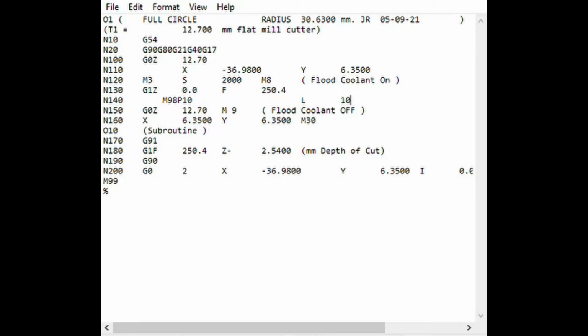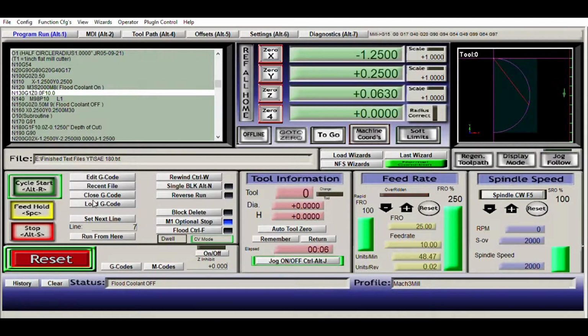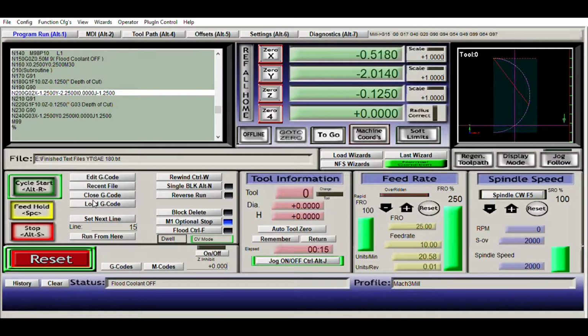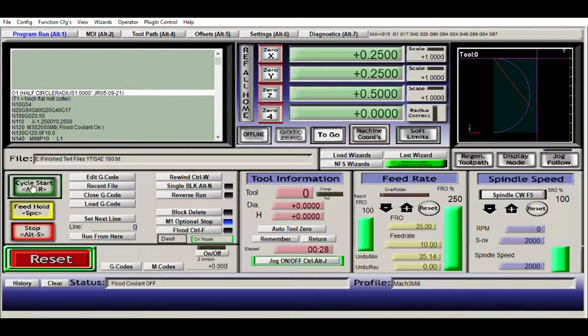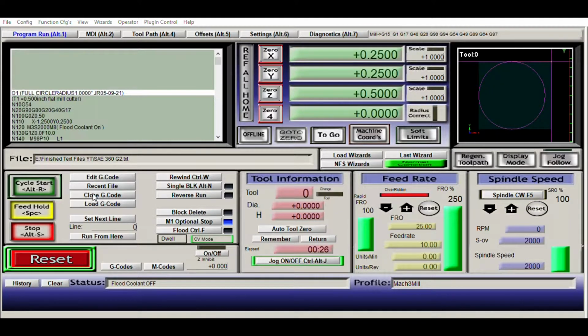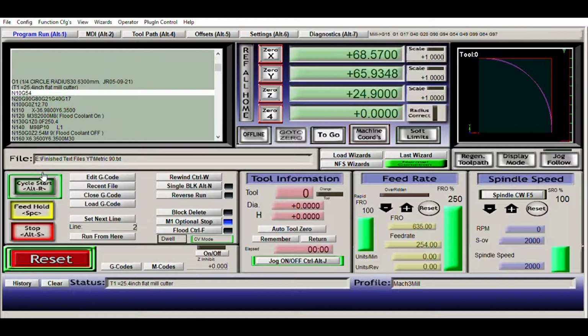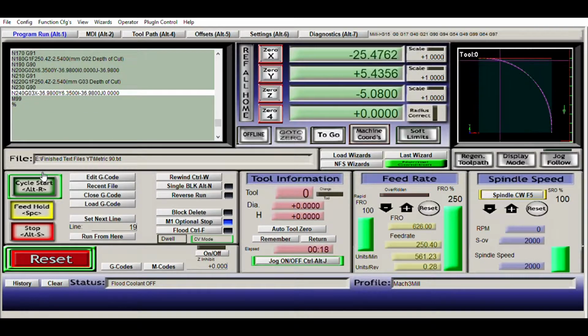I saved a copy of each of my G-codes on a thumb drive. Now I will load them and quickly run them with one loop and a feed rate of 250% using an older Mach 3 demo program running in Windows 10. Beware, some people have had difficulty running Mach 3 in Windows 10. If you have difficulties, contact Mach 3 for support. If you are a Linux CNC user, please let me know if my text files are compatible with your Linux CNC program.